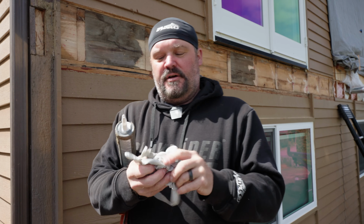All right, now that we've put in the sealant, what's the next thing you need to do? Well, you need to put a finish on it. As you can see on the house, somebody's already done this on the siding. They just took their finger and they wiped it down the wall like this. The problem with that is you can take too much of the sealant out of the equation. So there's not a whole lot of sealant now protecting the wall to the siding.